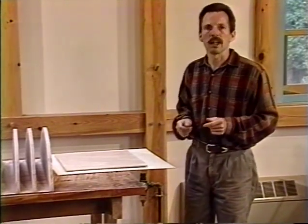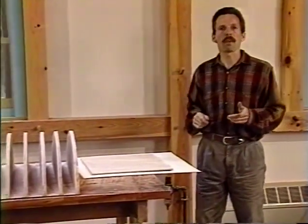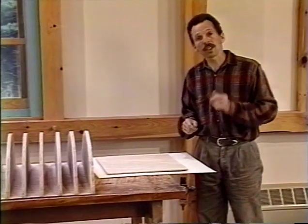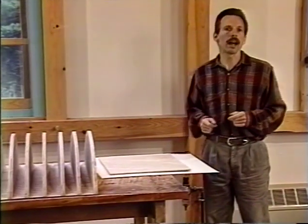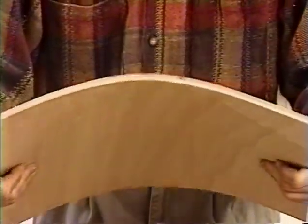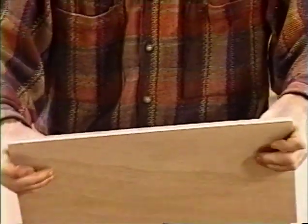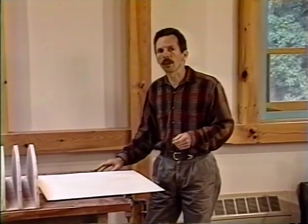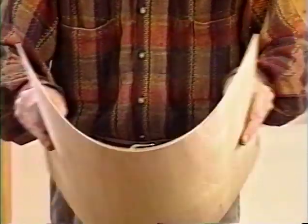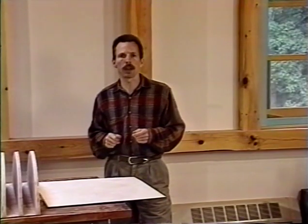The first method is placing ribs down the form at certain intervals. How far apart depends on how thick the skin material is and how many layers will be used. I recommend 3/8 bending plywood. This plywood is specially made to be very flexible in one direction, but fairly rigid in the other. There is an 1/8" bendable plywood, but your ribs would have to be placed so close together to prevent dishing between them, the form would become almost solid ribs.